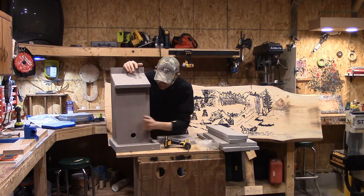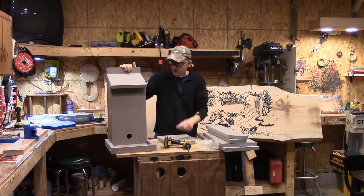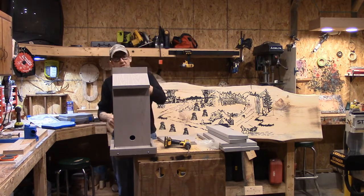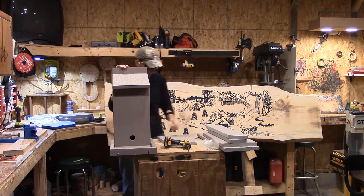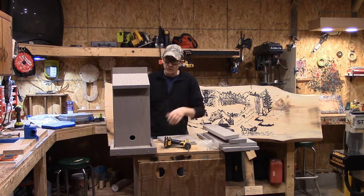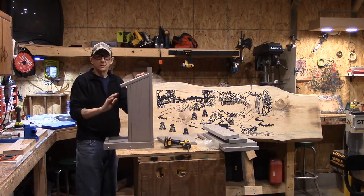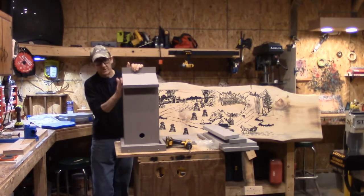The hole can go in after — get it down as low as you can. I told you we set this up with a little feeding tray so that when Mr. Tweety, before he goes to settle in for the night, he can grab himself a little bit of chow before he gets to the rack. We'll basically put a single quarter inch hole in the back to hang on the front of the facade. Take your sides, rip both edges off. On all our exposed outer edges, we don't cut them — we leave them just as is, which gives a nice appearance on this box.